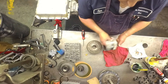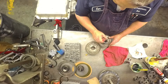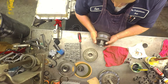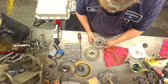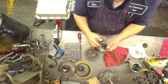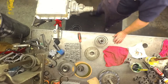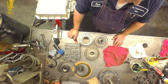When you put this on here — by the way, this is a four-tab washer that goes down in here. If it wasn't broke when you took the unit apart, replace it anyway — it's gonna break. If you look right here, there's a feed hole and a lube hole. I find the best area on here so I want at least one of these holes to line up with that so it gets a lot of lube down in here. These bushings are really bad about wearing out, especially these, and this one right here. Those are the bare minimum you need to replace, but I'll replace them all.